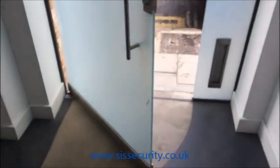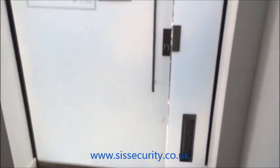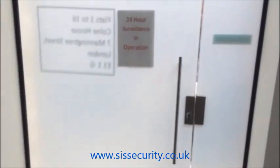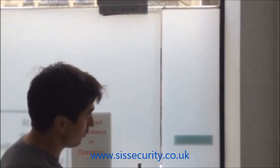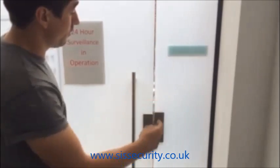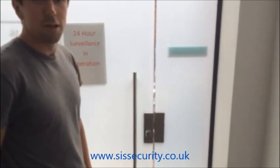If I let go of the door you'll see the first part of closing nice and quick, then it slows down at the end — and that will close even in the wind, even if you hold it a little bit away like that, which is a good test for a closer. If you let go of it and it doesn't close, that normally means you're in trouble. And that's closed.